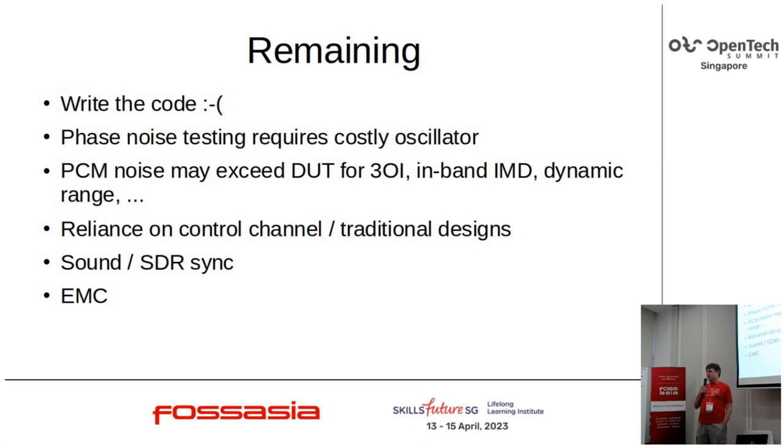So this is going to be a trade-off at any point. What I have discovered is that not only is the oscillator expensive, but computationally it's difficult. It's also going to be done computationally, and that gets into the whole issue that if you're doing an FFT, you've got to have buckets. And if the tone you're measuring is split between two buckets, then the two measurements bring you down. The fix is to do that, but easily said, hard to do.